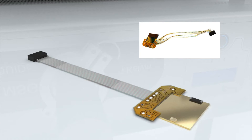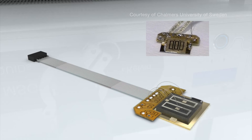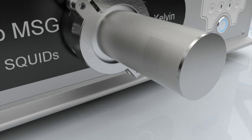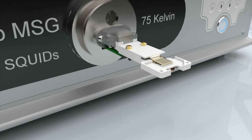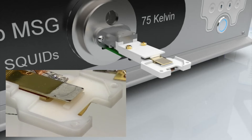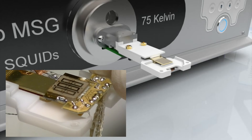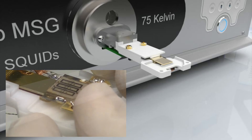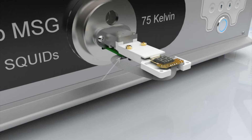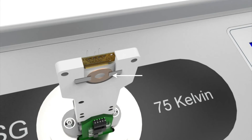Your SQUID can be connected to one of the loading carriers by gluing it to the heat sink area. Electrical connections are made using bond wires. The cryo cooler is situated inside a small vacuum chamber. The previously prepared SQUID carrier can now be attached to the cooler by gluing it to the end of the cold tip — using, for example, silver paint. The electrical wires can then be attached to the connector, which routes the signals to the SQUID electronics situated inside the system directly below the cold tip.